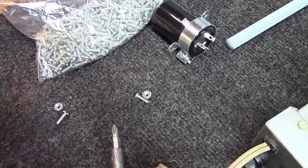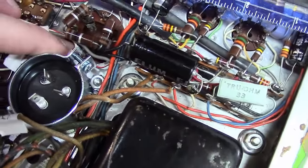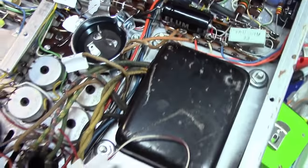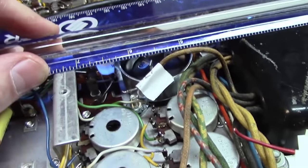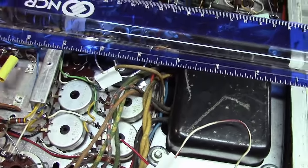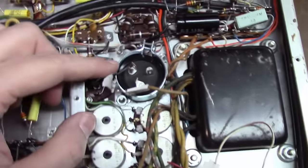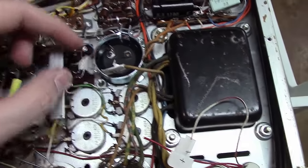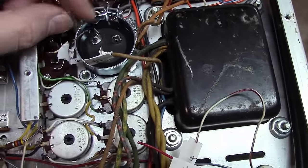You know, check the tolerances between the head of this thing and the next capacitor and all. We're good. And then I always like to run a ruler across and lay it flat on the chassis. You can see here I got about a 1/4 inch clearance, so I'm feeling pretty good about that as well. Okay, I'm pretty happy with the way it turned out. The capacitor's in there really snug. Everything's tightened down. I've checked to make sure these wires will reach everywhere we need them to, and we're going to be good there.